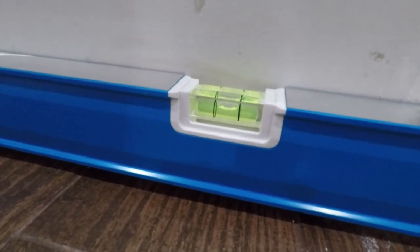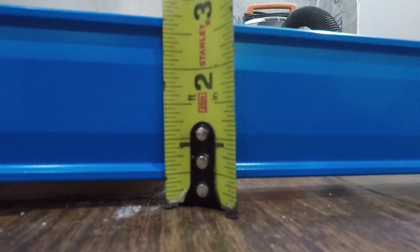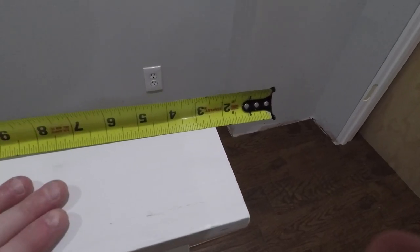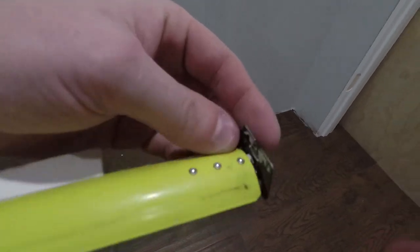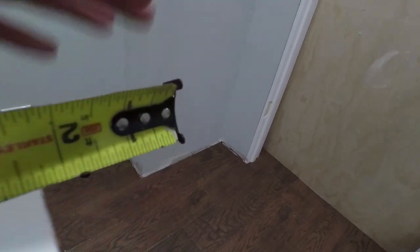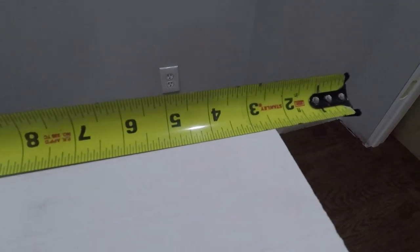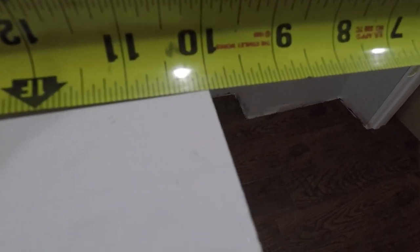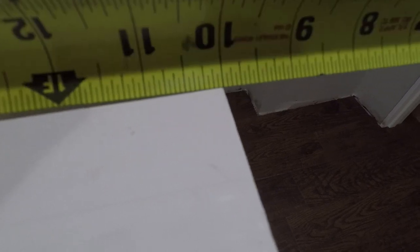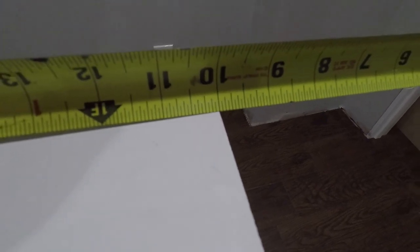Just to show you that this method also gets the same result — we're level here and then putting the tape measure right there, you can see we're right at seven-sixteenths. One other thing I've learned is that the end of the tape measure is never really the most accurate because it moves and stuff gets caked on there, throwing off the measurement. A lot of people solve this by 'burning' a few inches — I usually do 10. I set it to start right at 10 and then add 10 to all my measurements. So I'll make a mark at 10 and seven-sixteenths to keep it more accurate.